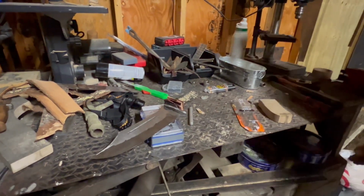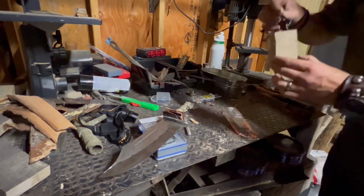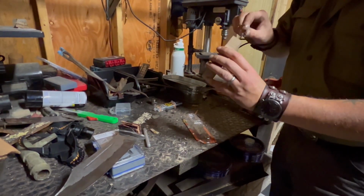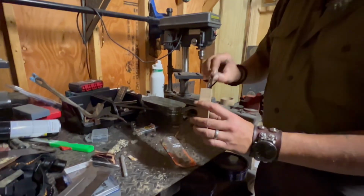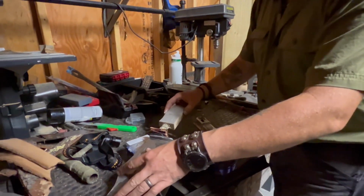Kind of helps because the epoxy is going to be encasing the sawdust, and the sawdust is going to act as that space filler, so we don't have to use tubes upon tubes upon tubes of epoxy to get the job done. It's a space occupant. Kind of like fall apart particle board. It's the same concept. So now, get the old wooden sock ready.